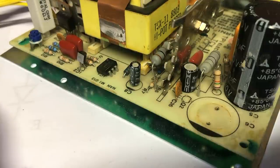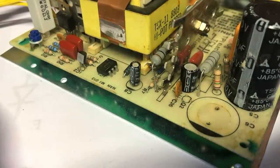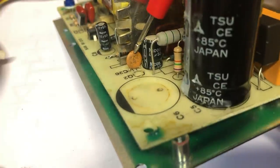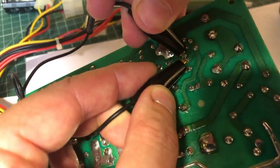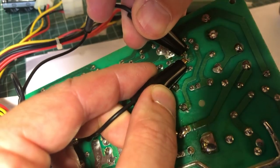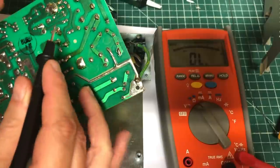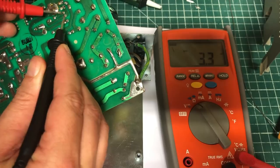It's not just the big caps worth investigating — this small electrolytic capacitor is also worth checking, as well as the ceramic ones. My ESR meter doesn't have the range for the smaller ceramic caps, but I decided to check this electrolytic one. As I was probing it with the ESR meter I got the reading: 'in circuit leaky' — this typically means there is a short.